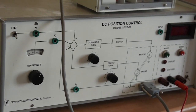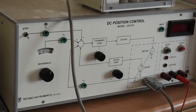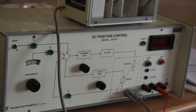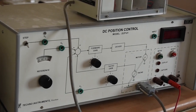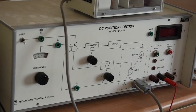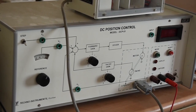However, the student is denied the feel of a physical electromechanical device. The present unit has been designed with this objective in mind. Despite the constraints like friction, dead zone, non-linearity due to amplifier saturation and motor current limiting, and low speed of response associated with any mechanical system, the student has been provided with enough opportunity for experimenting on a working system.